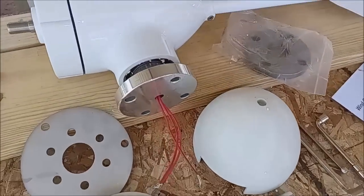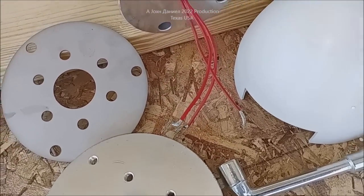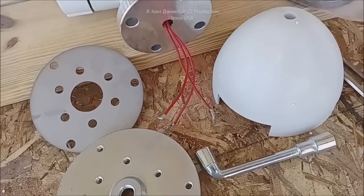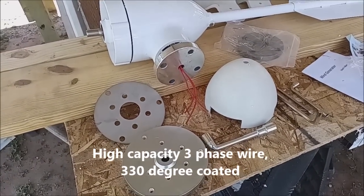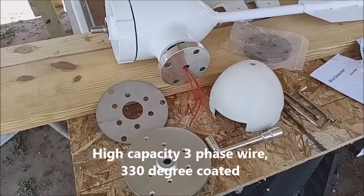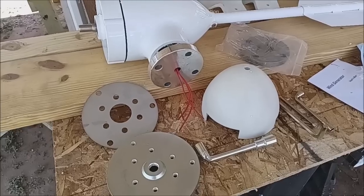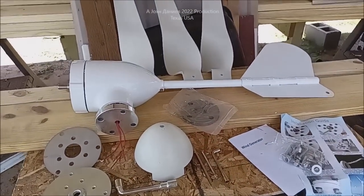Look at the heavier base. Now, people that are like, oh my God, that only looks like 14 gauge wire — it's not. It's a very thin, fire-coated, tinned wire. It is throughout the equivalent of about 12 gauge, but it's of course a very short run, and it's the kind of wire you have to use in them by fire code. You hook that directly to 10 gauge, and we'll be showing that in a very soon video.